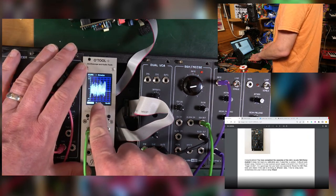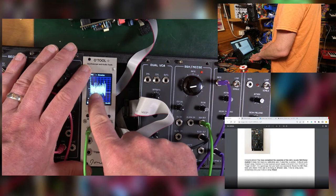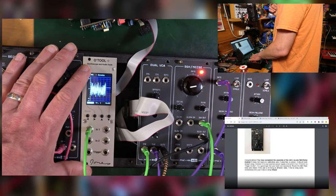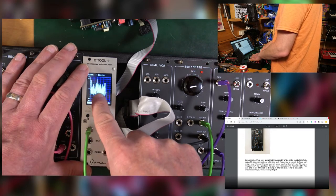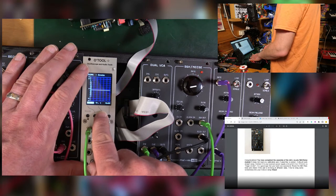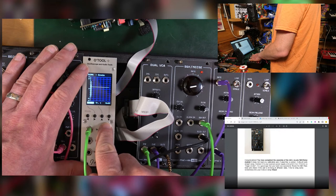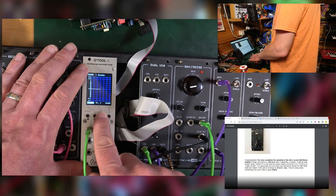And what we're seeing on the scope here, because I think this is the sample and held level, is either bleed from the noise or something, because I reckon this here is on the front of the signal. That's what I think at this point. Do you see what I'm saying? Those are the sample and hold things. We've just got this squidge of noise on the front. There we go. Starting to see it more now. Get this burst of noise on the front of each sample and hold thing.